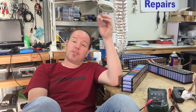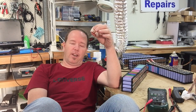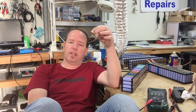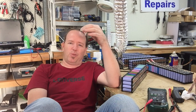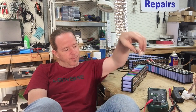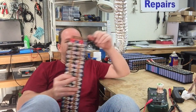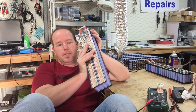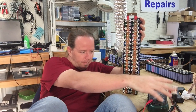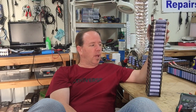Now, like an absolute twat, I did the test using a 12-volt inverter, which was pulling 12 volts at 4 amps. This will make sense once you watch the video. So I have — I just blew my fuse in this. It's got a 10-amp fuse and it blew the fuse. But I've got a still picture of this pulling 23 amps and not blowing the fuse.